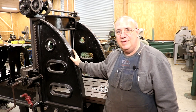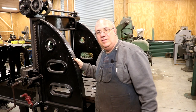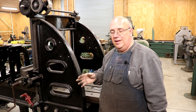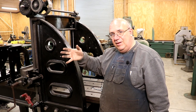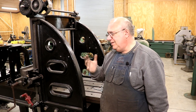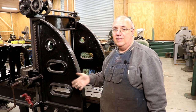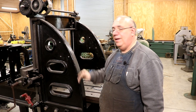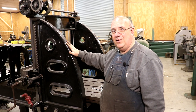I've got over here my brackets that I built. We fabricated those up a while back and it's taken me a little bit of time. I had to put a little body filler in those welded corners — I wanted to make it look more like a casting with a larger radius. Basically all we did was take some Bondo-type material, put it in there, did a little sanding, got them painted up. We've got those ready to mount back onto the machine.